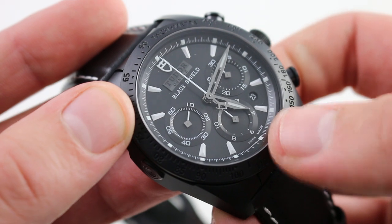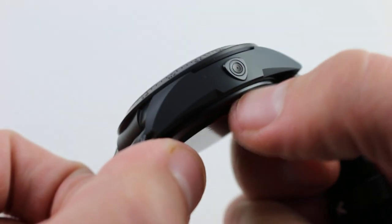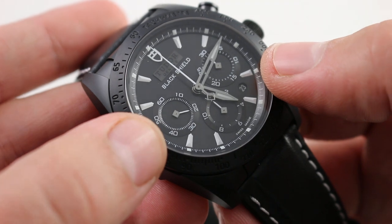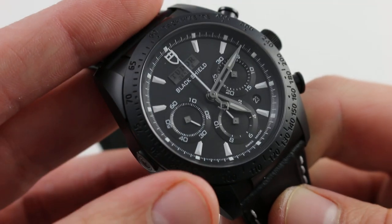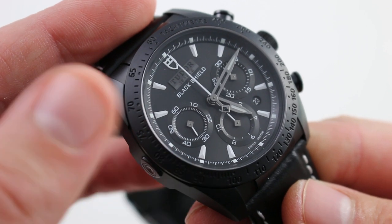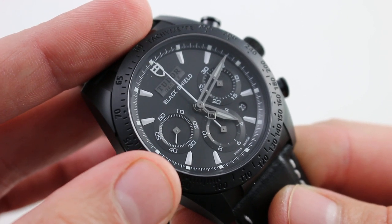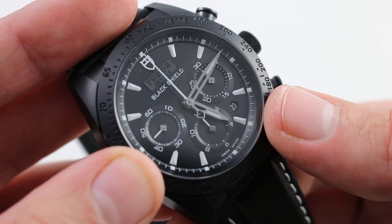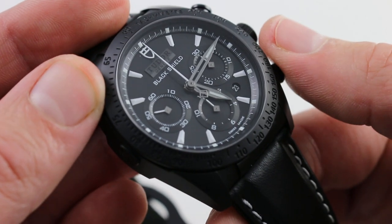The watch has a classic tri-register, bilateral symmetry dial, born of the Valjoux 7753 — a version of the 7750 with a conventional tri-compax dial arrangement, so all date adjustments are done with the shield-style pusher adjuster on the flank. The watch features all the virtues of a 7750, including high-efficiency winding — that famed unidirectional rotor wobble — winding the watch to its maximum rated power reserve of 46 hours. There is a date window, nice and discreet, at 4:30. It does feature a quick set, but only via the pusher adjuster, not through the stem.